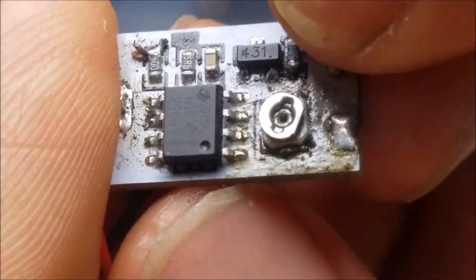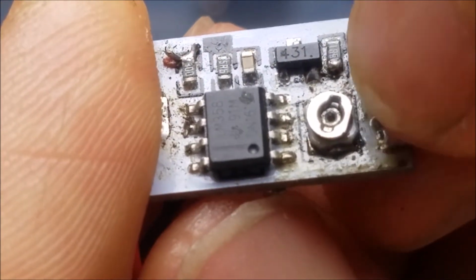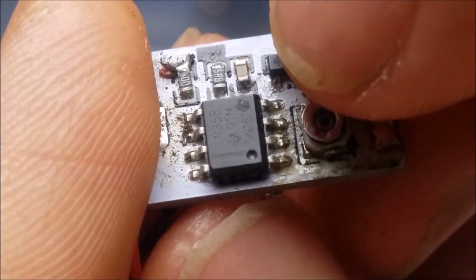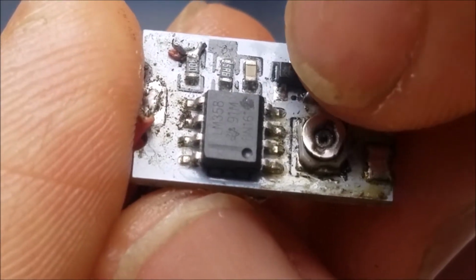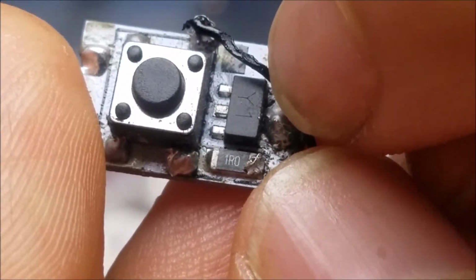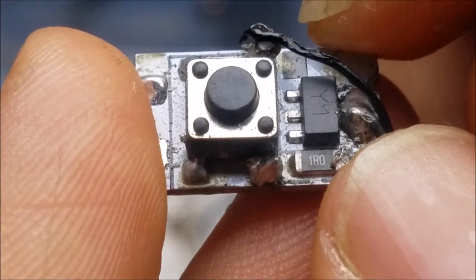And that is all controlled by this resistor divider network, the potentiometer and resistor here. And basically what it does is it controls how resistive the NPN transistor is. So this is basically a smart resistor, which gives us a very stable output.